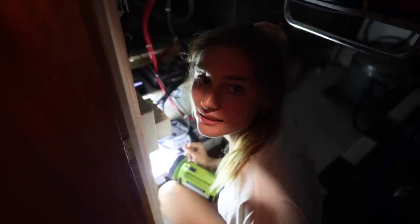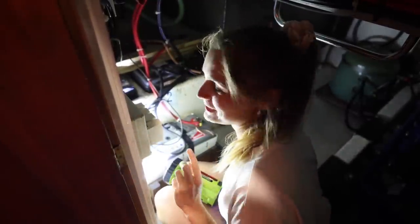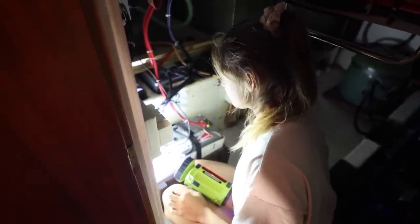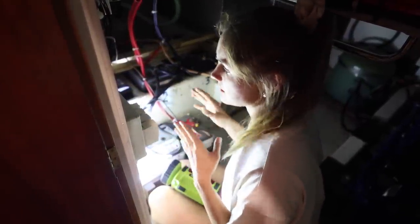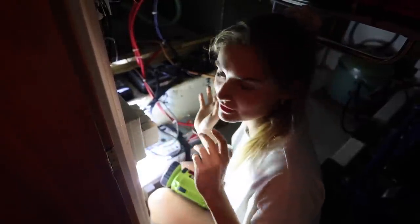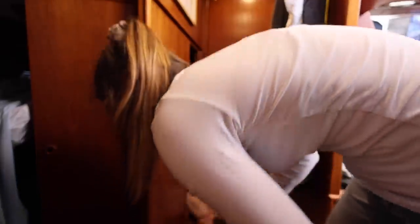I'm disconnecting the old batteries because we have a guy coming and we're getting four new domestic batteries, two new engine batteries, and a new bow thruster battery — a lot of batteries. We've gone for AGM, so they should be a bit smaller but much heavier. We're replacing them one by one exactly as they are, and next week we're going to move all the domestic batteries and tidy everything up. It's actually a really big battery locker — engine batteries and then domestics in there, with wiring holes already in place.